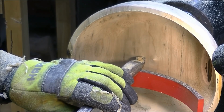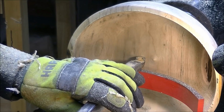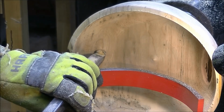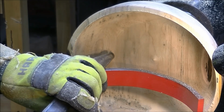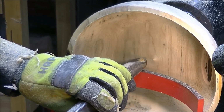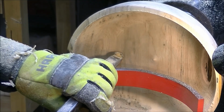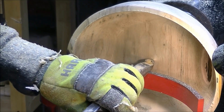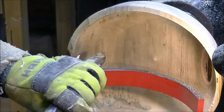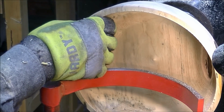because that's too aggressive, and plus it's easy to get catches. Because if you come in here square, you have to be just a little bit right here, and you come right here, it's going to ping on you, okay? So what I do is I always tilt it toward the direction I'm going. So if I get right here and I want to go this way, I tilt it back this way, and so forth. And I very rarely ever get catches. Now watch me get one, okay? I want to see how thick I am right here.